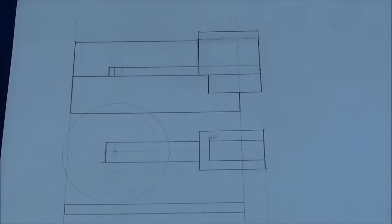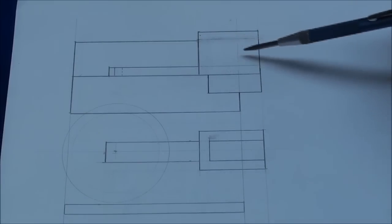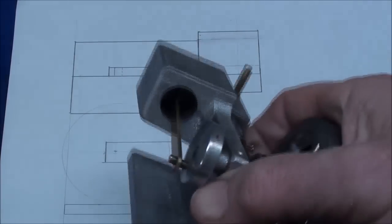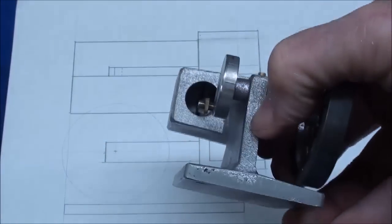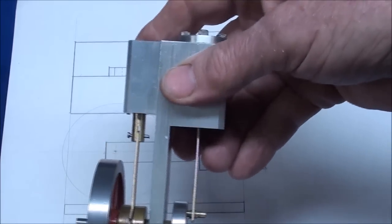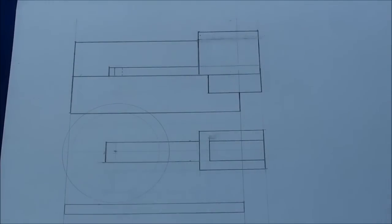You can see here where the valve is and the main cylinder. I have not shown any of the hidden lines in here. As far as the bore is concerned, this is a five-eighths bore with a three-quarter stroke, though I'm going to reduce the size of the bore to half or nine-sixteenths. As I've told you with other engines that I've developed, it doesn't seem to matter much what the bore is or the stroke — they all run quite well, because we're not trying to develop any real power here. That's enough of the drawings; let me show you the next step.